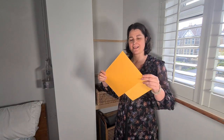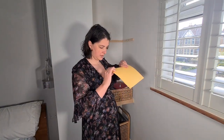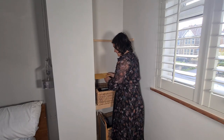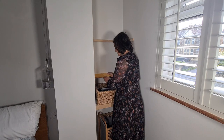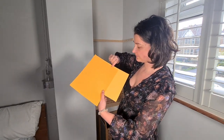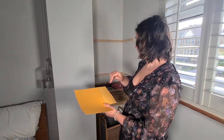If it's not 90 degrees, perhaps it will be slightly out or in. Let's see. That corner is pretty much 90 degrees exactly. Let's try the other corner - I think this is the more wonky one. All you do once you've found the right angle, hold it, get a piece of tape and just tape that there. When I go downstairs in a minute, I can draw this angle on my piece of wood and that's how you get the correct angle. That one I'll do at 90 degrees and this I will do at that angle and go from there. Let me get some tape. Now I don't have to hold it.